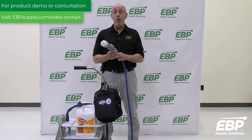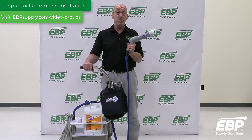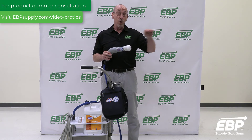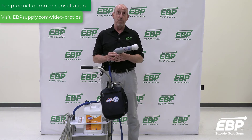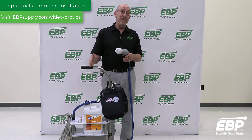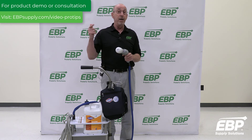So aside from that, productivity will skyrocket. This particular electrostatic sprayer is made by Clorox, called the T360. It comes out at 35 psi so it actually propels that disinfectant with a pretty strong force across the room. And then we get the wrapped coverage by charging those molecules, which allows us even further productivity. We can do 18,000 square feet within an hour and fully get every surface that we couldn't normally get with a trigger sprayer.